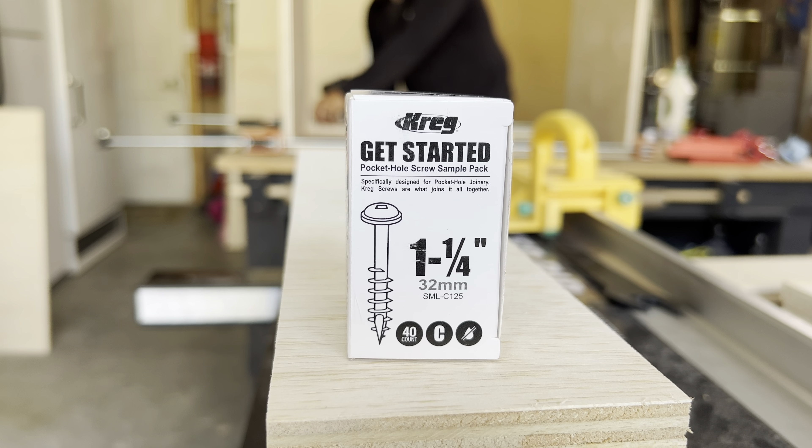With the ceiling hangers and threaded rod now affixed to the underside of the miter station, we added a couple additional nuts that will sit on top of the 1-inch angle. The pre-drilled holes on here are 5/16ths of an inch — we are going to bore them out to 3/8ths to fit those threaded rods. With our system all assembled, we can put our saw in place and really start to see this thing coming together. Now we've got it roughly where we want it, so we're going to bolt it down and then make our adjustments after that.